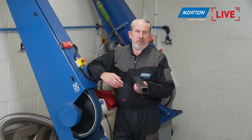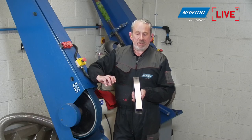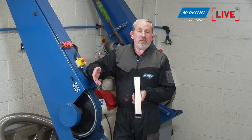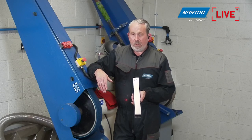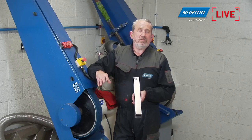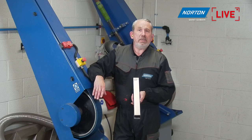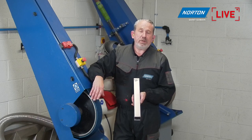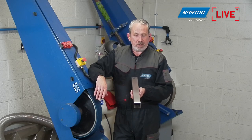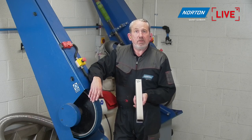One other way we see customers use these non-woven type products to get an even better finish than we have now is by using some kind of coolant or oil-based lubricant. An oil-based lubricant would give us an even better finish. I've seen customers use pure oil as a coolant or lubricant in their process, which gives a really special finish to this product. But obviously on this machine it's not possible because it would be everywhere, so not a good idea.